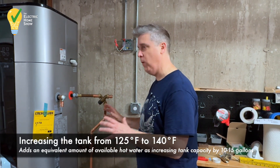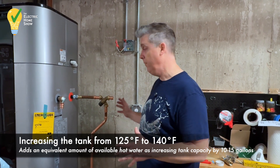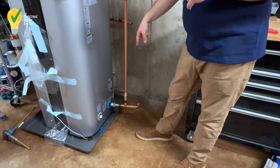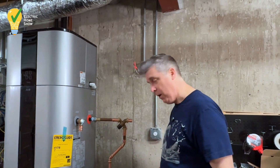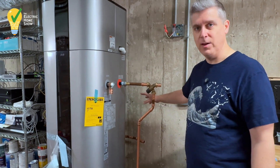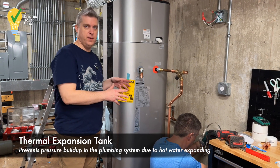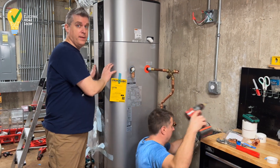This thermostatic mixing valve — they do have a way of calculating it. I want to say it adds 10 to 20, maybe 30 gallons of 120-degree temperature water after we turn it up. And then we have a check valve at the bottom there so that the hot water doesn't go back in. Right now we're just working out all the angles so we can put in our expansion tank and then connect everything up to the previously existing cold and hot water lines. The thermal expansion tank is a safety mechanism — when you heat water it expands, so the water that expands goes into this tank rather than the tank itself.